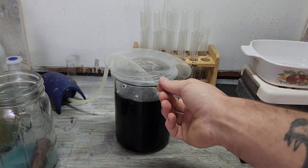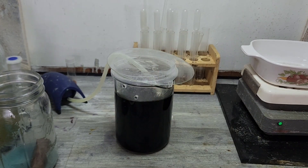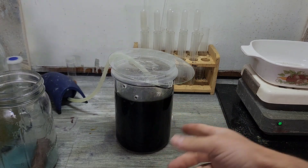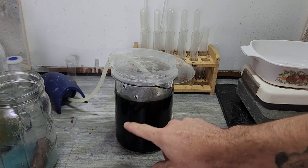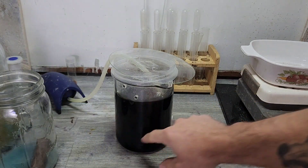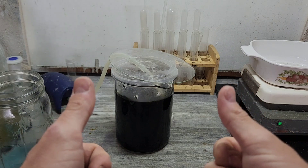We're going to let that sit — not sure if the top is going to sit on there very nicely, we'll have to figure that out. I topped it off: about 700 mils of copper(II) chloride, then introduced about 100–200 mils extra hydrochloric acid. We should see some gold floating around here soon, and we'll have some foils to refine.